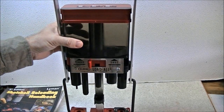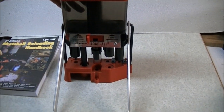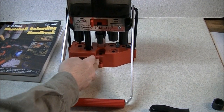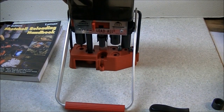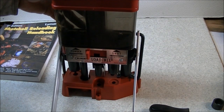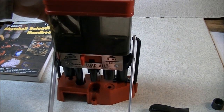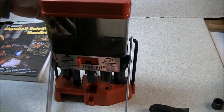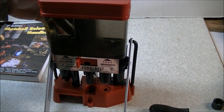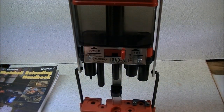One thing about this machine: if you look at the way the handle depresses, if you mount it too far back from the edge of a bench the handle will actually run into the table. So it's necessary to mount the machine quite far to the front of the bench — the handle goes down about two inches lower than the bench surface. You can just depress the handle mechanism down to see how far back you can go, and obviously you want to give yourself some hand clearance as well.